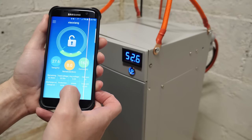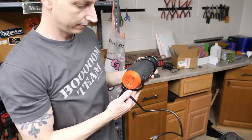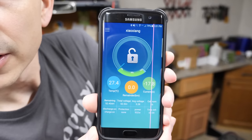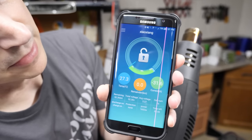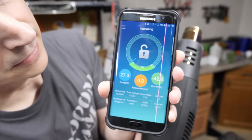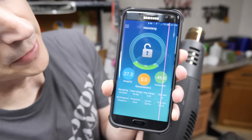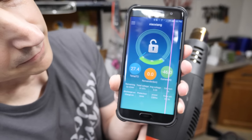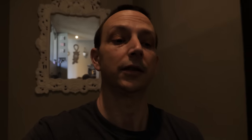Let's see what else we can power. I added three more LED lights and plugged in the heat gun — on low we're drawing 31.6 amps; on high it jumps to 46 amps total, about 2380 watts. Heat gun — no problem.